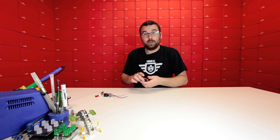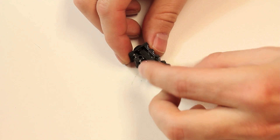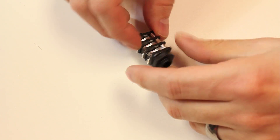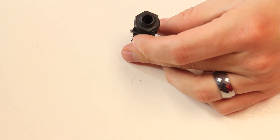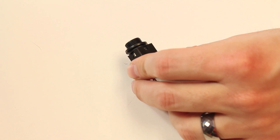We had a lot of jacks last week and we've got a couple more this week. Here's a couple of quarter-inch jacks. We've got this one, which is a right angle because it's right angle to the board. This one is interesting because it has switch detect. If you look at these pins, we've got three and three, and when nothing is plugged in there is actually a connection between the left and right-hand side. However, when you plug something in, this little tab lifts up and breaks that connection, so you can use this to detect when something's plugged in. This is a quarter-inch stereo jack — like a microphone or headphone jack — and it comes with a washer and nut. We also have the same thing in a vertical mount, which mounts vertically on the board, and it has a washer and nut as well.